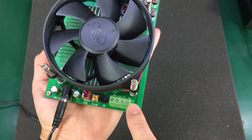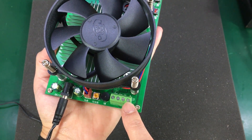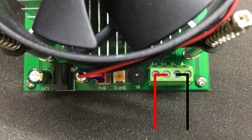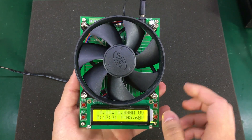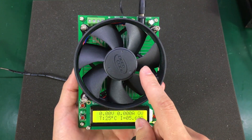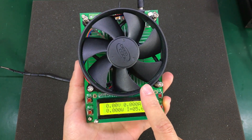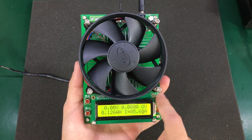The load is capable of and should be used in four-wire measurement mode to eliminate measurement errors. If you want to use it in two-wire mode, you'll need to bridge the terminals for correct operation, as shown in the picture on screen right now.